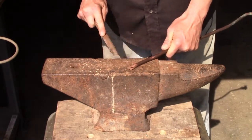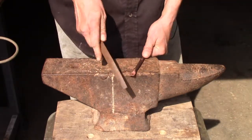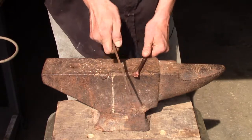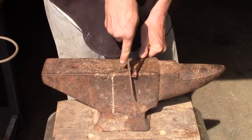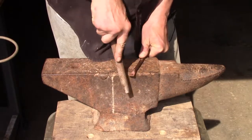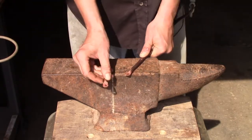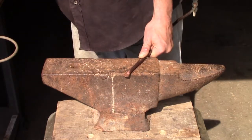Next, take your file — you'll have some burrs on one side or the other. Just file it a little bit. I usually do both sides just to be sure. Then you take your file and round your edges off: number one, so they're not sharp. Now, if you have a grinding wheel it's going to go a lot quicker. I got it somewhat rounded — not as good as I did on the first one, because that one I actually took to the grinding wheel, and it goes really quick when you do it that way.